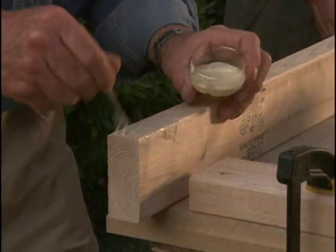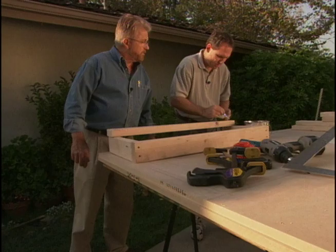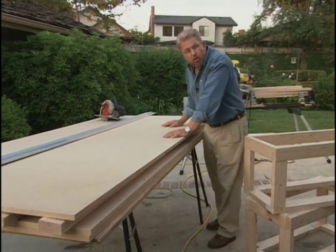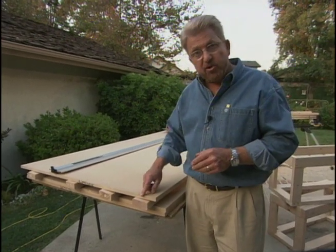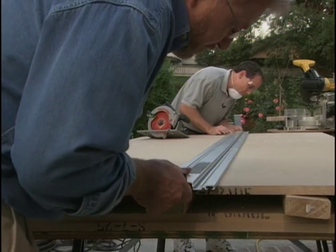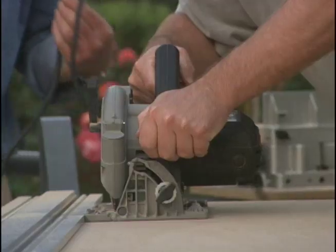Starting with the bottom, apply glue to the joining surfaces and attach them together using long screws which are deeply countersunk. Those are our two bases. We've finished our frames and now we're going to cover them with three-quarter-inch-thick MDF, or medium density fiberboard. We're cutting this with a circular saw, set up on four two-by-fours so that when the saw finishes the cut, the pieces won't move, pinch, or bind the blade. We're also clamping an aluminum straight edge to the fiberboard, which serves as a guide for the base of the circular saw to make perfectly straight cuts.